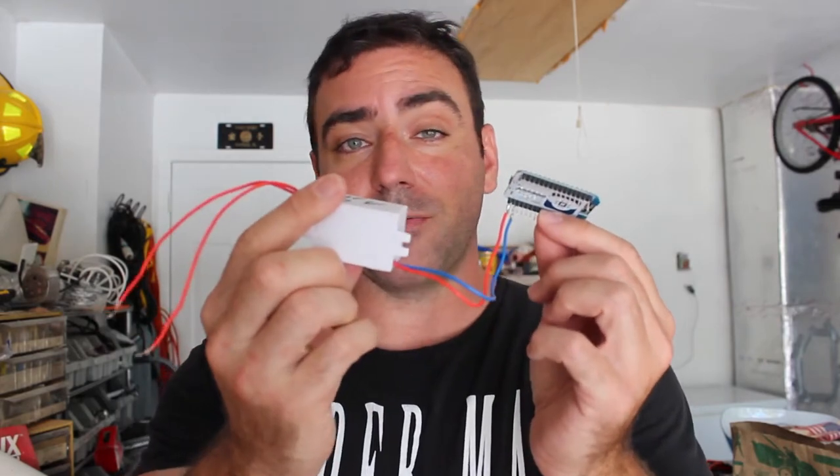The second URL will also text me if the pump runs for five minutes or more. I'm doing this because I recently had an underground pump that ran and ran and ran due to another problem that wasn't shutting it off — that's close to a $1,000 problem. This is $3 and change — $6 total — and it will alert me if the pump is running too long and log every time it runs so I can see how often it cycles.